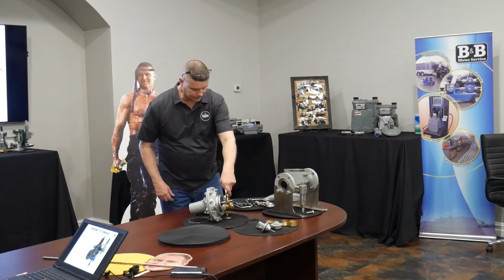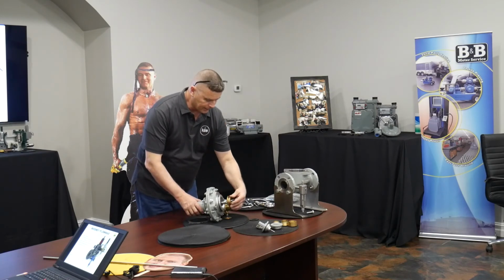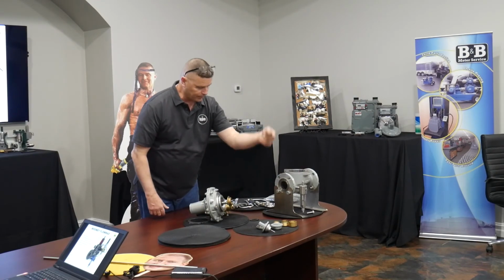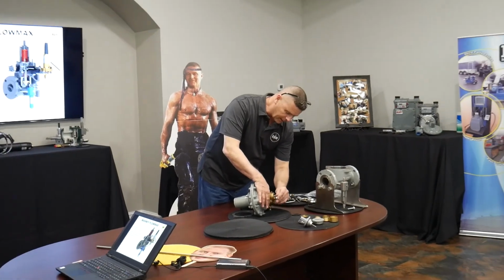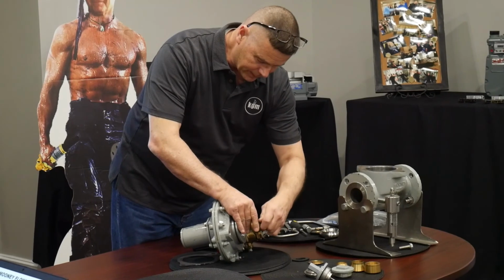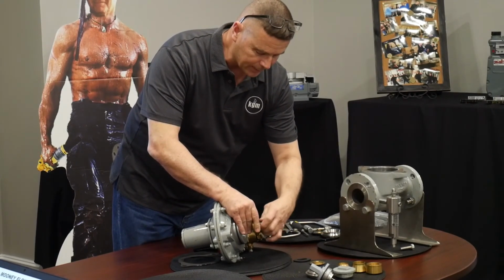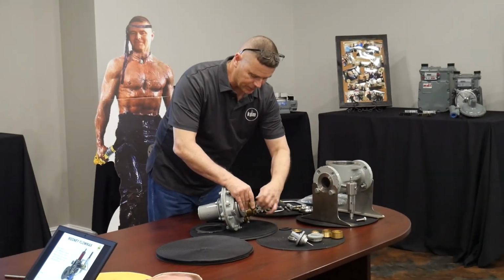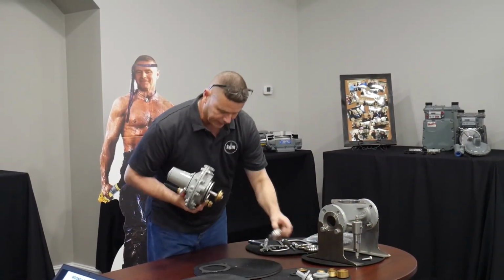Okay? Questions on that? Low flow range extender, you hear a lot about it. The low flow range extender basically just mounts in place of the 100%. I put my nut back on that holds it there. And what I get is, initially when I want control of low flow and I want the valve to be partially open to manage that low flow better, this is what it looks like.